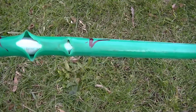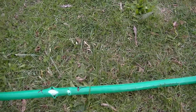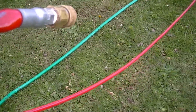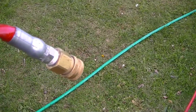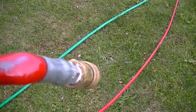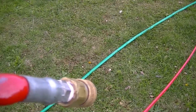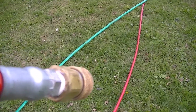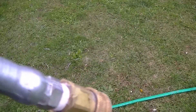And then they dragged this over something sharp on the trailer or whatever and busted that skin. And the same with this hose — this is the 3/8 inch, it's fairly new, but because they didn't disconnect the hose and wrapped it up, you got that big kink. So I'll cut that off. If these were older hoses, a year or two old, I'd just replace the hoses, but these are really new so I feel pretty confident that just new ends will work nicely, instead of having to buy four hundred dollars in hoses or more.